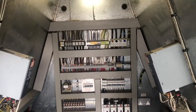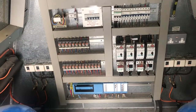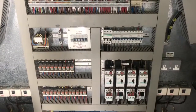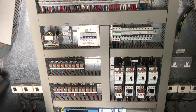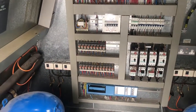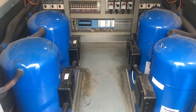Like everything else, we need control equipment to manage the cooling process. The BMS controls the contactors, which are protected with circuit breakers. Then we have the inverters which drive the condenser fan motors, and then the compressors which pump the refrigerant through the system.